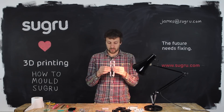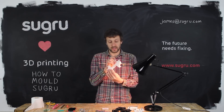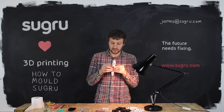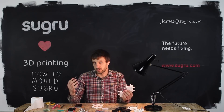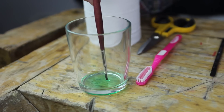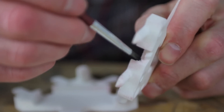First thing — make sure that when you assemble the mold, the two parts meet and you have a very tight shut line. If not, you might need to sand it down or file it down a bit to make sure the parts meet perfectly. Next up, apply washing up liquid, which is the release agent, directly to the parts of the mold that come in contact with Sugru. Just paint the detail in a very fine layer.